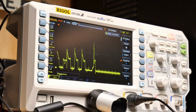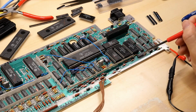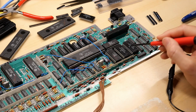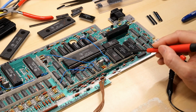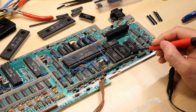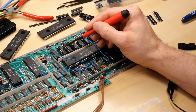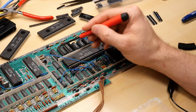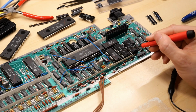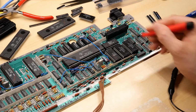So now I have a thought. So the new CPU is in, and yet we're seeing exactly the same thing on that data line. Now I tried putting in Sam's new SRAM chip into this socket and actually swapped them around. I tried all 3 chips, and nothing ever changes on that data line. So you know what's left? Oh, well, and I know I changed out the 373 latch. In fact, all 3 of these are new chips that work. So all that's left is this ROM chip. And perhaps the output on that data bit on this ROM chip is not strong enough to drive the bus.